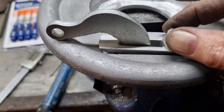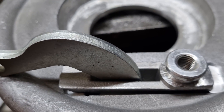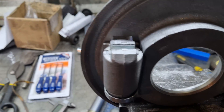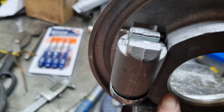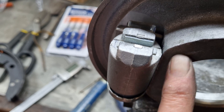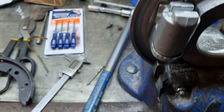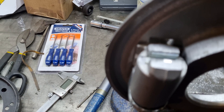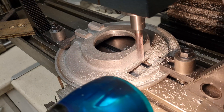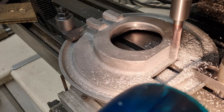Although the slot and the slave cylinder are now dimensionally correct and it goes in, the whole device should be able to slide back and forward and I can't actually move it just now, so I'll have to put it back in the milling machine. On closer examination the tightness is caused by not enough room down here, so I'm going to take about 0.5 of a millimetre off, as I can't push the cylinder further over without encroaching on the drum. I'm confident the template is fine — it's just casting tolerance causing it.